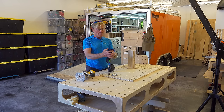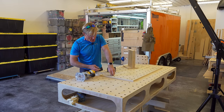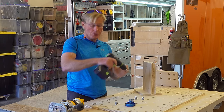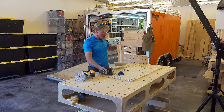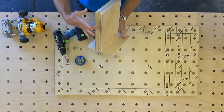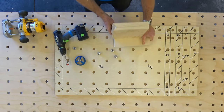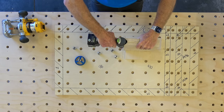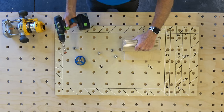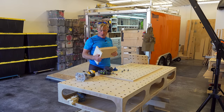I chose this drill guide because it's aluminum and has the advantage of a V cut-out, which is good if you're drilling through anything round like a dowel. It also comes with different inserts and I'll have a lot of uses for it beyond just making the template. You don't have to buy this — you can do it by eye, or you can make something like this shop-made jig. It's just a piece of plywood with 45-degree cuts on the ends of one piece of 18 millimeter, screwed together and spaced with a piece of 12 millimeter, with another piece of 18 millimeter screwed on the bottom. It just helps you drill straight down. I can put my drill on here, drop the tip into the hole, eyeball it, and run it down. Not quite as good, not as fast, but definitely something you can make with scrap in the shop.